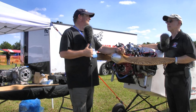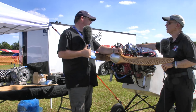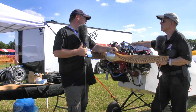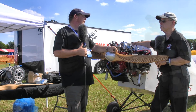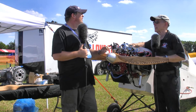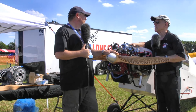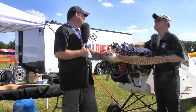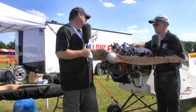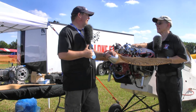If I wanted an engine like this, how soon can you deliver? What we like to do is sit down and customize our engines to the customer's needs — discuss it and get an outline of what their engine needs are, take a deposit on parts, and then you're looking at about a three-week turnaround time. The key questions we'd ask are: weight of aircraft, speed of aircraft, and the duty of the aircraft. Over a certain speed, the gyroscopic loads on the propeller start cracking the front of these cases. Once you get over 100 miles an hour, we go to a different bearing with twice the thrust area than the front bearing in a standard VW.